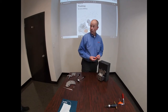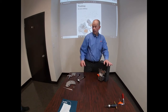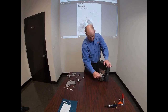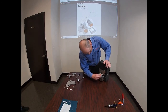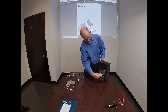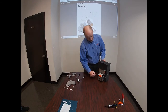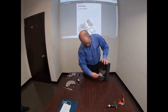We can make an adjustment using that cam pin and dowel pin. Accessing the hole in the nose and treating it as a left-hand thread — turn it to break it loose. Then we can access the cam, and as you turn the cam you can see the fixture move. At that point you indicate across until it's true, then go back and treating it like a left-hand thread, tighten it up.